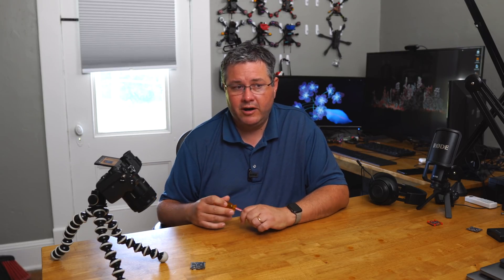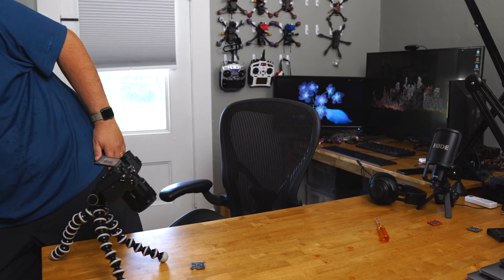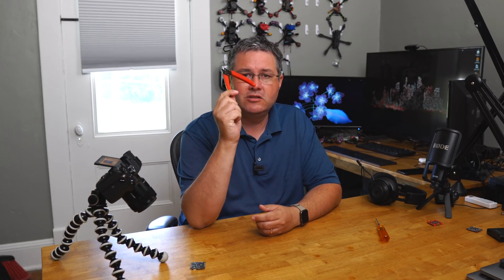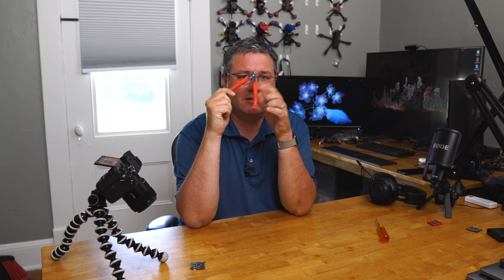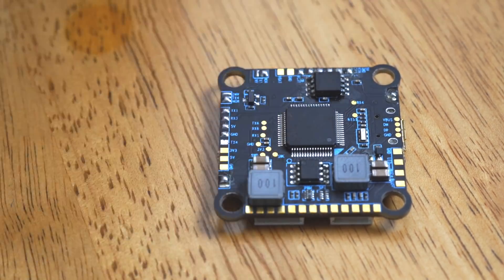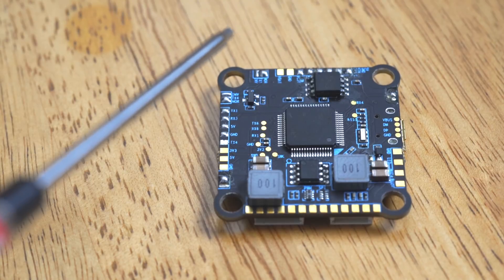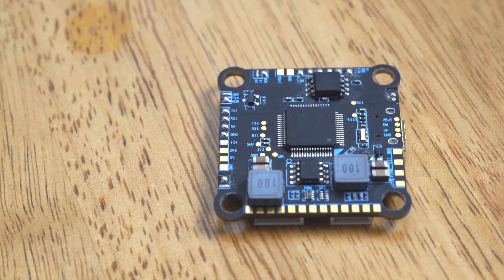If you want to make sure there are no problems with shorts, remove the VReg. What I like to do to remove the VReg is use flush cut dykes — they're very sharp, very flat, and super cheap. If you don't have these, buy them. You can basically cut the little metal pins on the chip as best you can, the chip body will come off, and then you can heat up the individual legs and remove them one by one. Once the chip is gone it'll remove easily one by one. You don't need a hot air station.